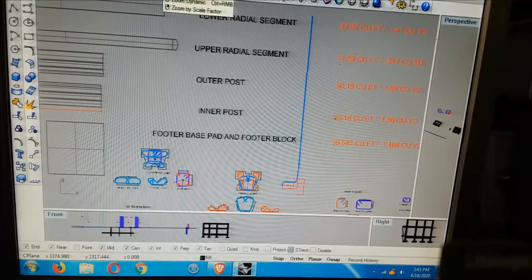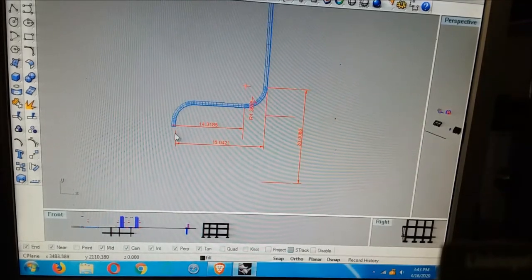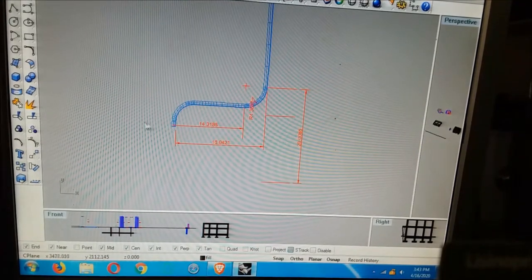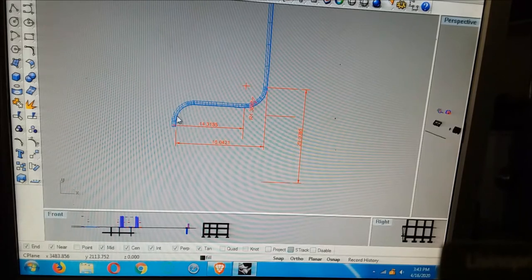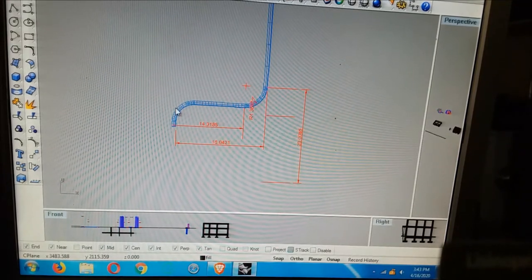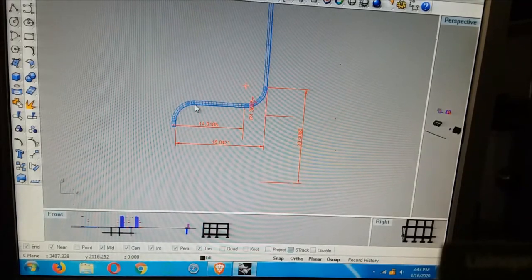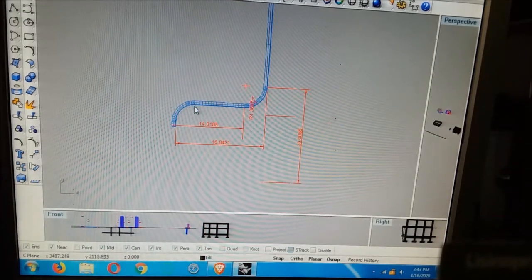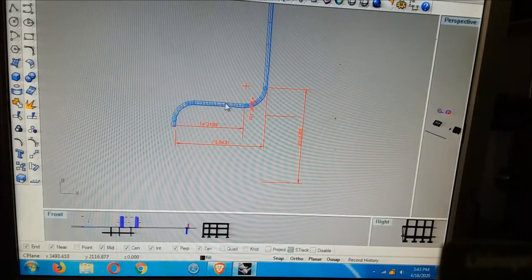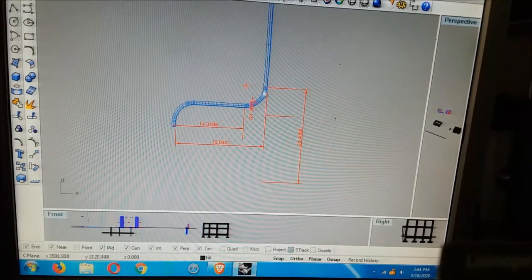But what we're going to look at here is not that. We're looking down here. You've got a foot here that rests on this big monolithic block in the ground. It's got a bend here. It's got the same minimum bend radius... no, it hasn't. This is bent around a piece of 6-inch Schedule 40 pipe. It's an addition on the side of the bender, still hanging on it today. But it's got that big wide radius bend, and here's another one up here, because we wanted a better load path coming through here than it would be if it had that tight bend on it.